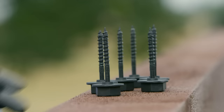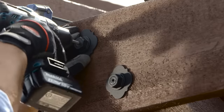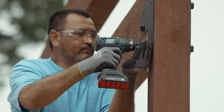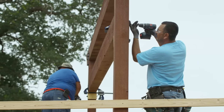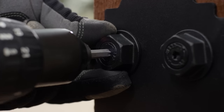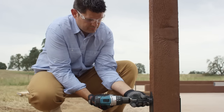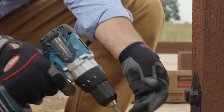One of the features I like best is the innovative structural screw and washer combination that Simpson Strong-Tie developed for this new line. It looks like a bolted connection but installs as easily as a screw with no pre-drilling. This hex head washer is load rated and so innovative that there's a patent pending for its design. If you've ever tried to drill through holes in a 4x4 or 6x6 and keep them straight, you know that driving a screw is a lot easier.